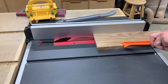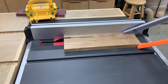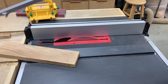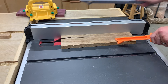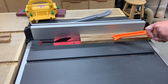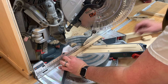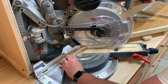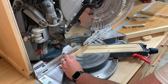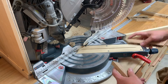While that's in the clamps, let's turn our attention to the holder or stand for the coasters. This is just off cuts of white oak — three quarter inch material, cutting these into one inch strips. For the thinner coasters that were only about three eighths of an inch, these were a little chunky. For half inch coasters this might look just fine. What we're going to do is basically cut 45-degree angles into these pieces — you're essentially making half of a picture frame.